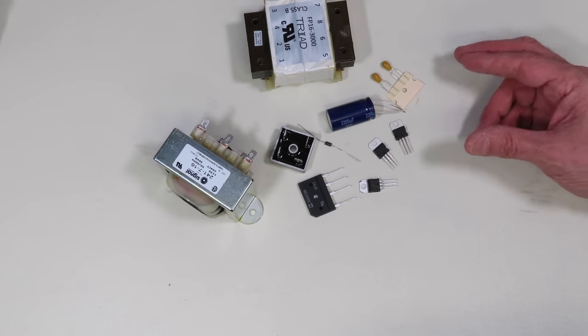A common configuration is to have a center tap on the output, where the voltage is half the total output voltage. Transformers can also be tapped on the input to allow multiple input voltages — common for equipment that runs on both North American 120 volt and European 220 volt power. When selecting a transformer, you select it by its input and output voltage specifications and its current capacity in amperes or volt-amps. Another design is the toroidal transformer, which, while more expensive, doesn't radiate an excessive magnetic field — very useful for audio and other sensitive equipment.